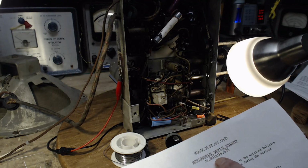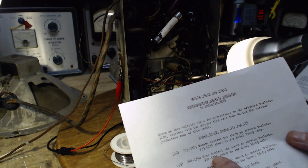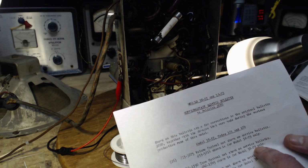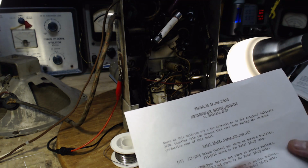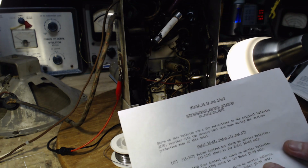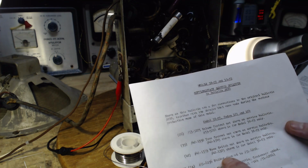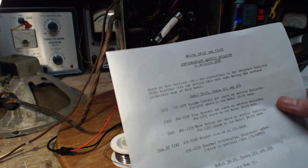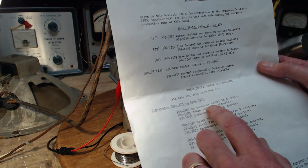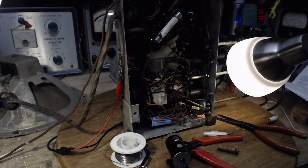So this is the service bulletin, isn't it? Oh, so-and-so is shown, that is shown is for model 38C9 only. So what they're saying is, I think, there's stuff shown on the schematic labeled C7 that actually is only in the C9 radio. That doesn't even make sense. I'm not getting this. Pattern changed. Thermal compensating condenser added. I'm going to have to look at these. Shadow meter added. Bezel plate removed. No. Well, I don't know what to make of it. Then we're in a dumb situation again.